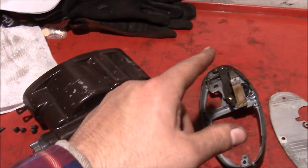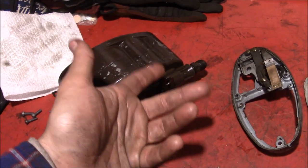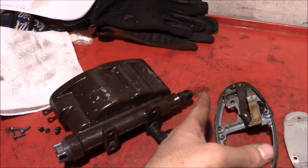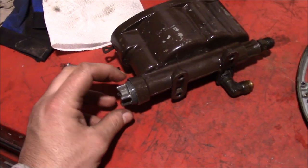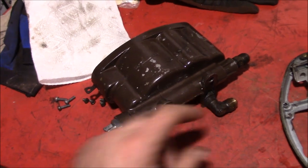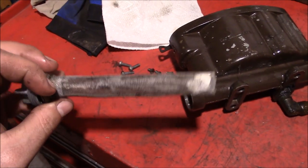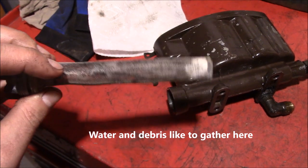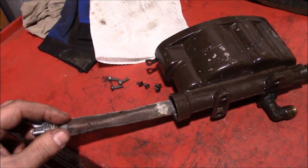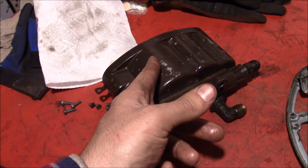You should have a filter upstream of your inlet if you're on a big tank or whatever. That's how we have ours on a 200-plus gallon tank — there's a regular 1A30 or whatever filter, and then it runs into the furnace. However, there's an additional filter that's part of this control valve right down in this cavity in the body. It's not a super fine filter — basically just a screen — and it's your final defense against any dirt or debris that comes through the inlet before it goes into the control valve.